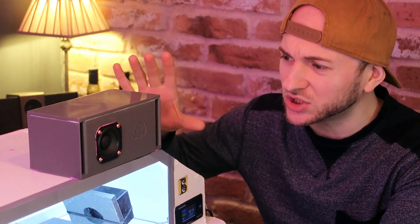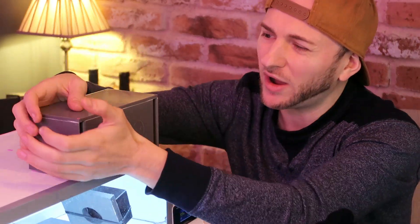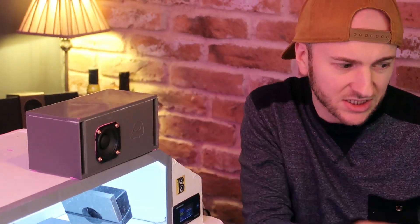At 198, blocking the left-hand port makes it quieter, whereas at 150 it got louder. Blocking the right-hand port at 198 Hz completely kills it. So at 33 scaled hertz, it seems like we're using both ports and they're both important. At 270 Hz — that is potent, that is loud, lovely and clean, not many distortions. Blocking one port makes it very slightly quieter; blocking the other also a touch quieter. So I think we're going to be mostly listening to the cone now at these higher frequencies.